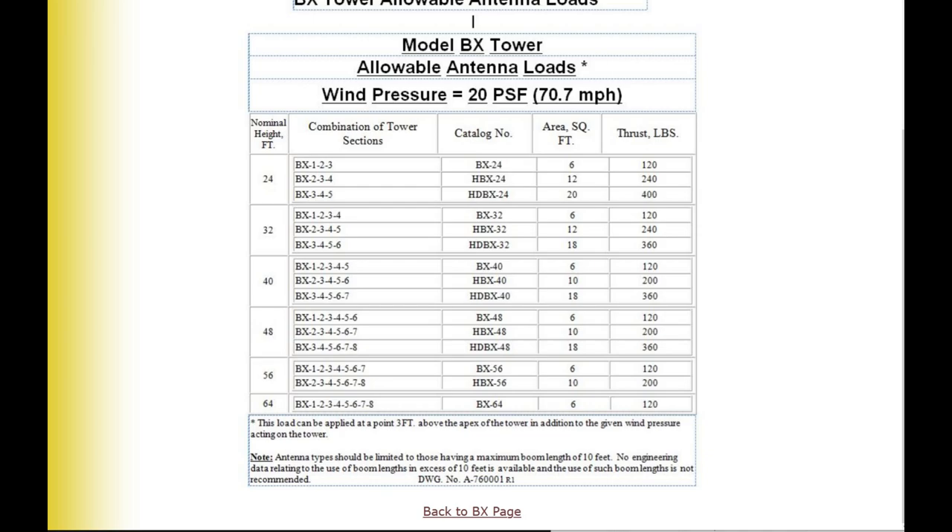There's also information about wind load limits for this tower. I'm not going to overload it — a beam is not high on my list right now. I've moved to Middle Tennessee, some distance from the main repeater sites in Monticello and Nancy, Kentucky, so I want to make sure I can reach those repeaters. There's going to be a Yagi pointed north toward those repeaters, and I'm also going to use something at the very tip-top — either an omnidirectional antenna on the very top — and then possibly a beam toward the top of the tower but below the mast.